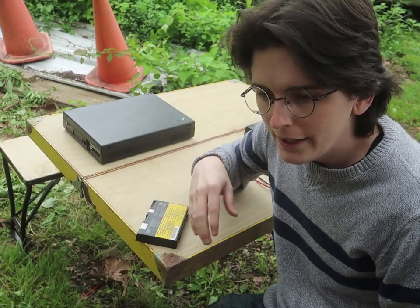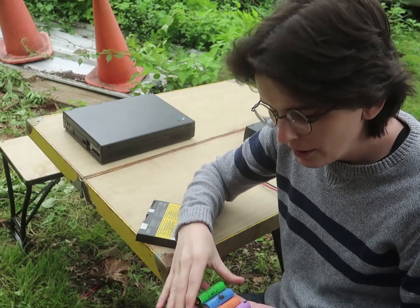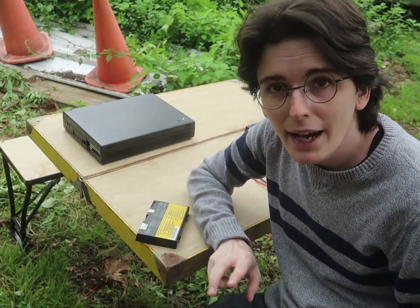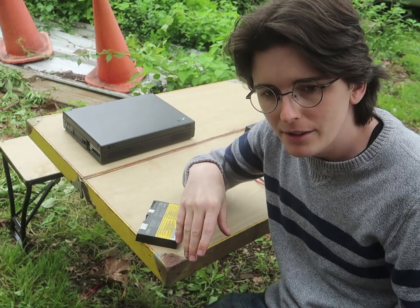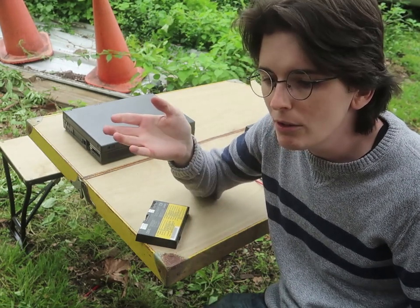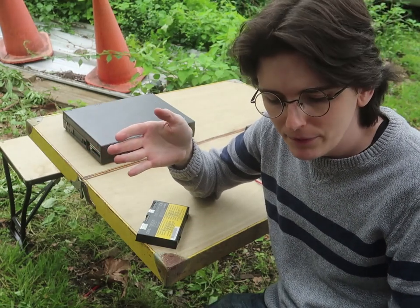And so you can go through and test them, usually in a battery pack. Like if it's a 12 volt pack, it'll usually have like 2 in parallel and 3 in series, so 3 packs of 2. And usually just one pack out of the 3 will be bad, and the other ones will be good. So you can go through your battery packs, rip them open, and then usually most battery packs, even if they're old, will have a few cells that are still good.